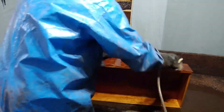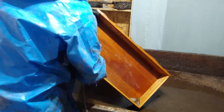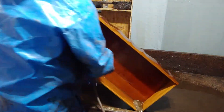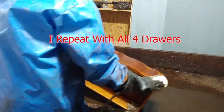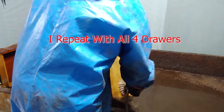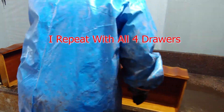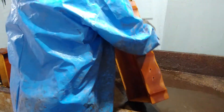It's worth mentioning that this same job can be done with hand stripping. I could easily just hand strip the face of these drawer fronts. If I were going to hand strip it, I wouldn't do the inside of the drawer — I would tape off and paper off the inside of the drawer and just strip the face of the drawer front.